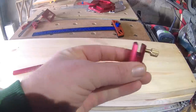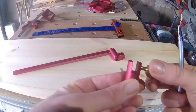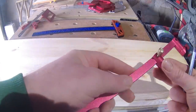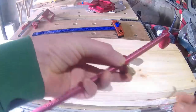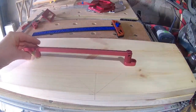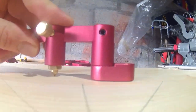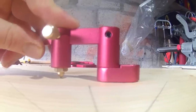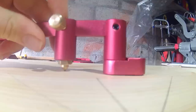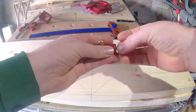When loosened, the center pin will come right off. The rule slot has a machined flat bottom to keep everything straight when fixed, but the rule does need to be flat to it — this is where I found a minor issue. With the center pin close to the marking foot, the rule flat to the pin, the foot will rock. You could loosen and lift the centering pin, but then it won't be seated and you can't guarantee straightness. Left as is, with the foot able to rock, you'll get inaccurate results, broken leads — it's just pointless.